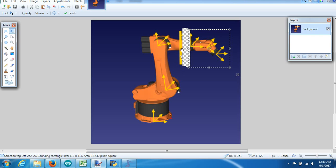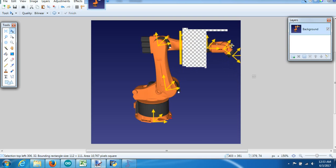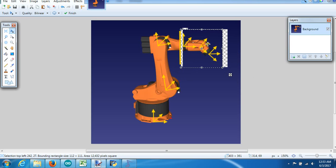Inverting rotational matrices is not a lot of fun, and that's one of the more difficult parts. So what we're going to get into is: how to first calculate this frame, how to invert this frame, then how to calculate all these angles, how to stick the wrist back onto that frame giving us the new combined rotation, and then from that we'll extract the values for joints 4, 5, and 6.